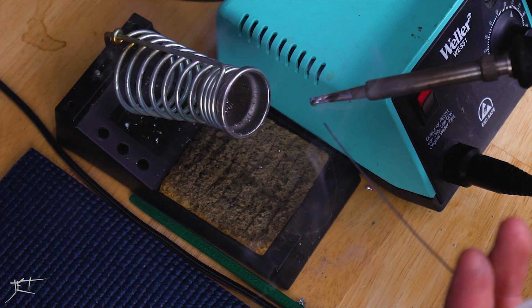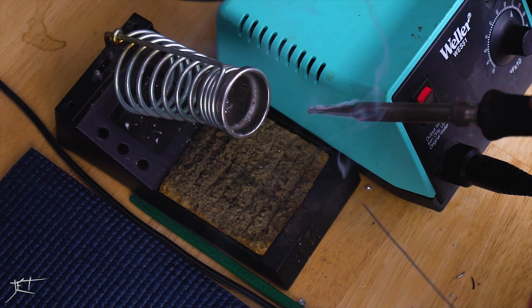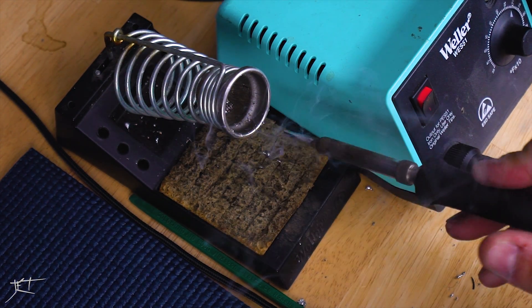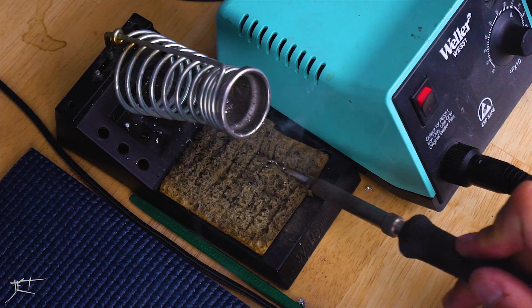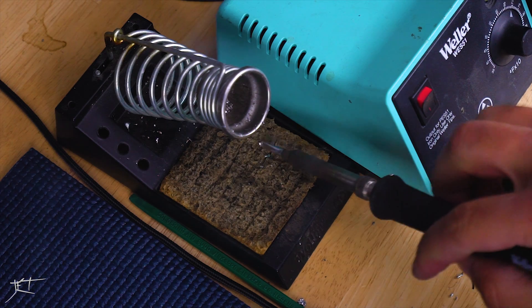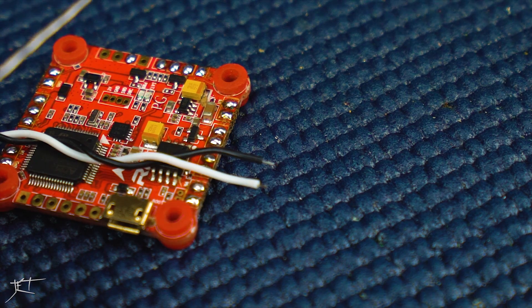You want to tin it up and then wipe it on a wet sponge like this to clean off any oxidization or old solder that's stuck to the tip.